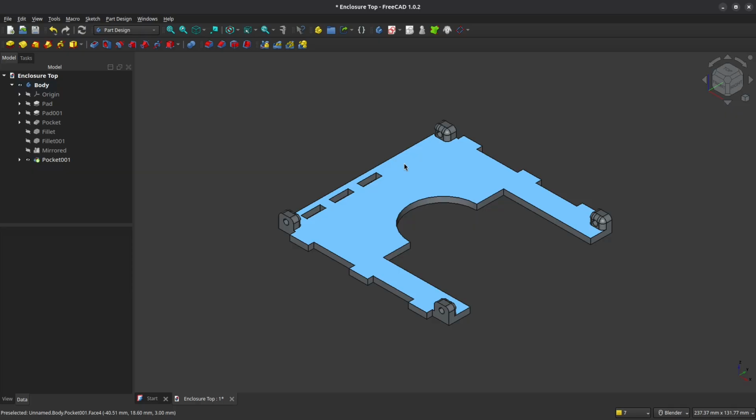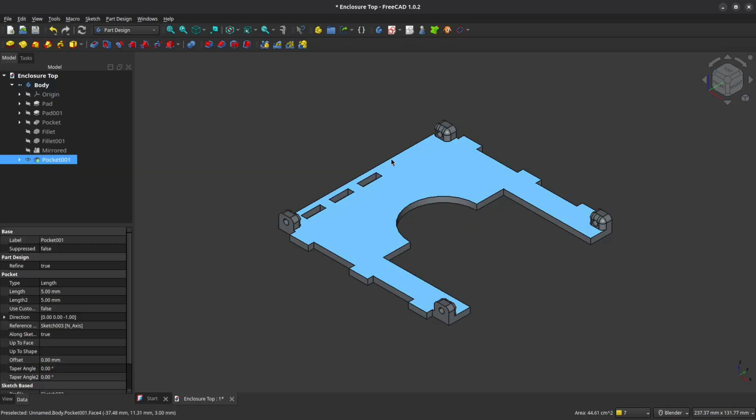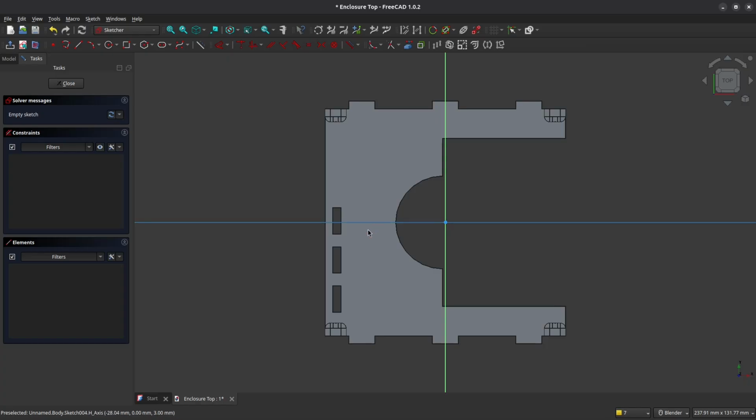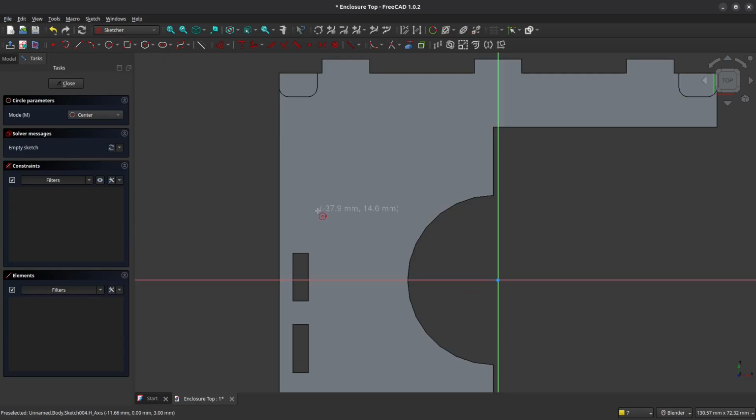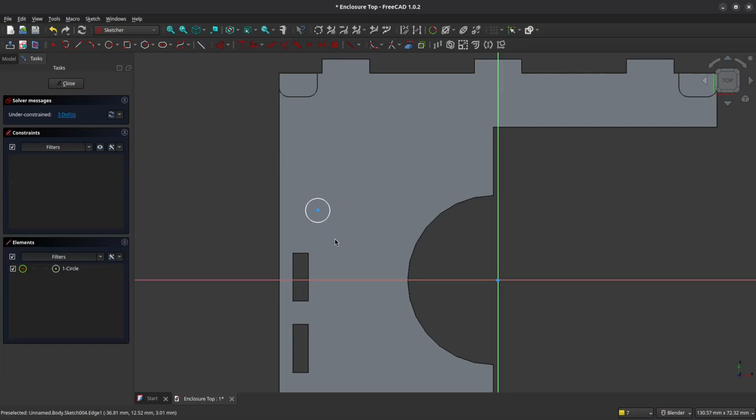And we need to add one anchor point. We want to make sure that the rear panel can't just fall out of its tabs. The way we've designed it would make it really hard. But this is just one additional anchor point. This will be a screw that ensures that the back panel can't fall off of the rear of the enclosure.